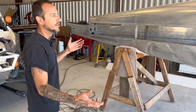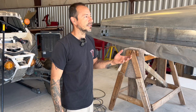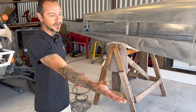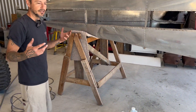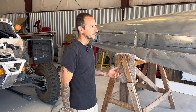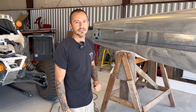What we do is we buy them and source our parts. There are still legal parts — it's always up to the A&P/IA to inspect the parts when you receive them and check the background of the part to see if it's legal to use. Like the gearbox — we bought it off eBay, off a donor plane. We did the background check on the plane, got a tag on it, fully inspected it, and found it to be serviceable. That's how we are able to do these kinds of projects. If we had to buy it new, we buy it new, but we try not to because it's very expensive.